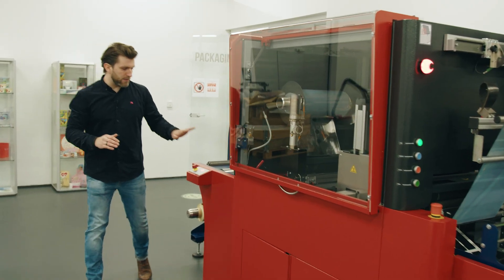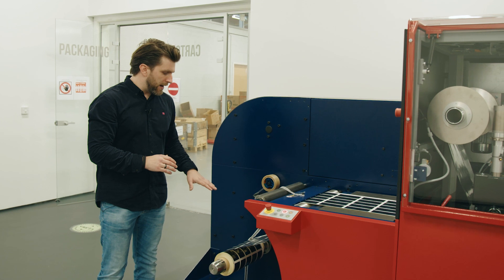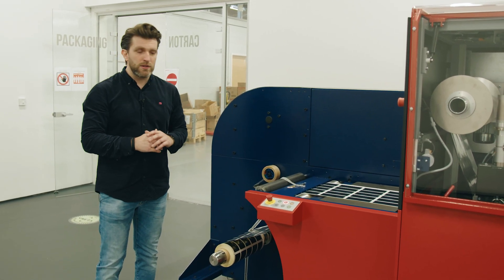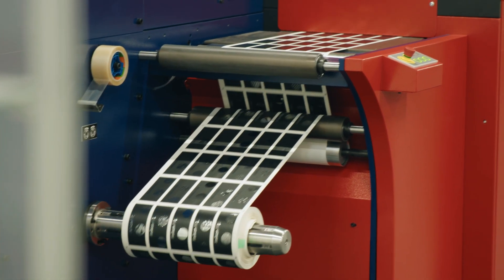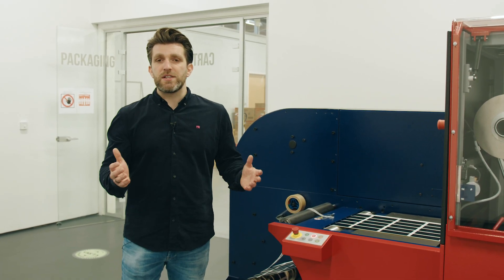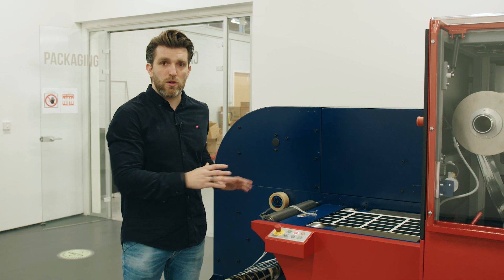After the foiling unit, we are at the end of the machine: the rewinder. It's a standard servo-driven rewinder for good tension, can go up to 850 mm — same as the unwinder. Optionally, you can have a second rewinder shaft fitted; the standard shaft is 76 mm or 3 inches. Another option on the FEU is a conventional die cut system equipped with a gap master, enabling companies to have rolls, embellishments, and label converting to a finished roll all at once.